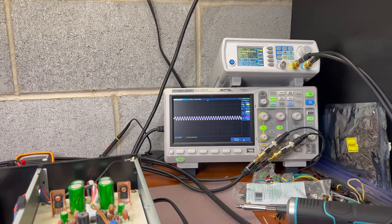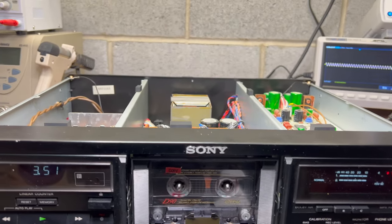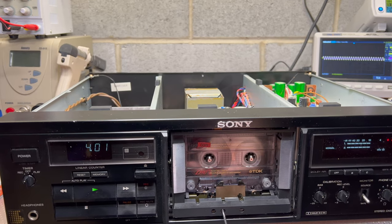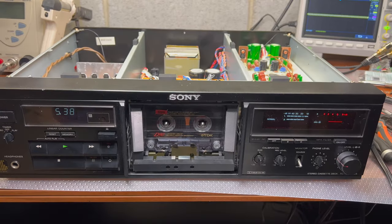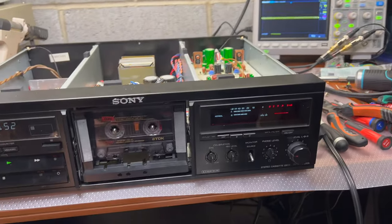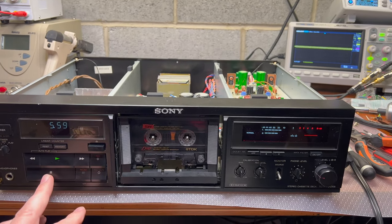Oh, 10 kilohertz. Let me see the level. The level is there. So I may check Azimuth, but this looks to be fine. Let me check it right here. I don't see. Okay, I need two hands. Give me a second. See you soon. Okay, guys, Azimuth was spot on. And I went on to 15 kilohertz. Azimuth is pretty good, as you may see here. However, on 15 kilohertz the levels drop a little bit. But for this age of deck, it's pretty fine. It's not drastic. It's just a few decibels on 15 kilohertz.